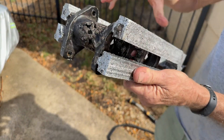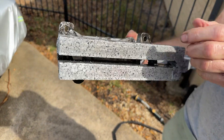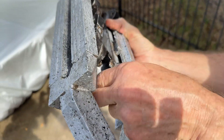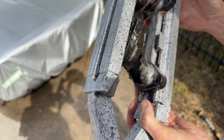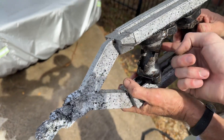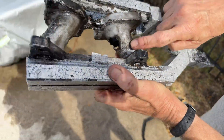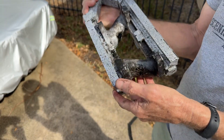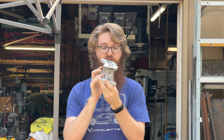We have something to check center-to-center measurements on — the top and bottom — to see if we have accuracy in the print. This is actually a fairly thin wall — sixteenth of an inch. We probably need to bump that up to three-sixteenths. I think if we cut the gates off it'll stand on its own. The back side is fully formed — it looks so good from this side and not so good from the other.